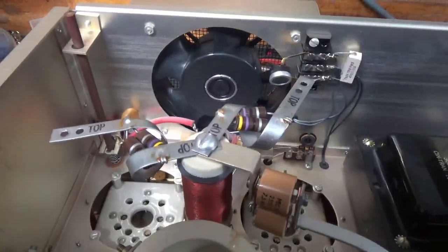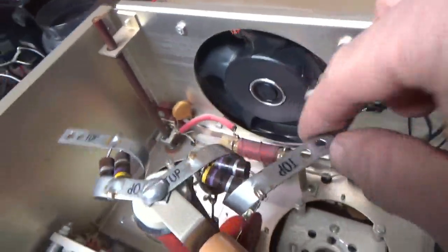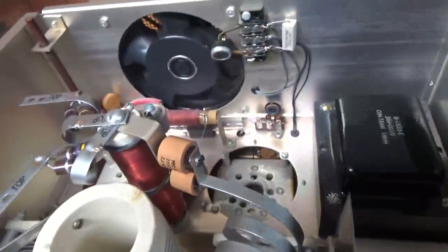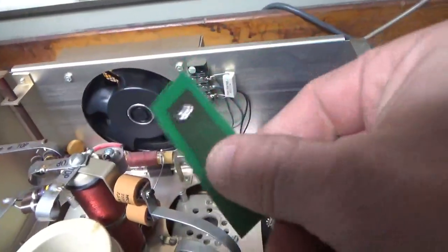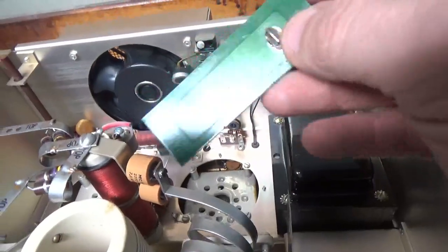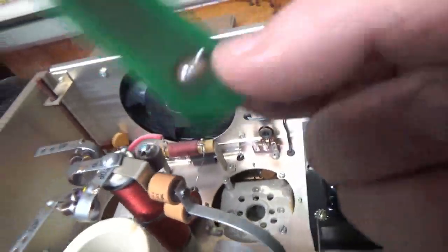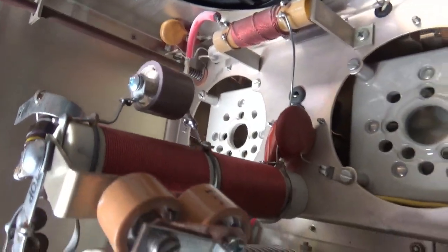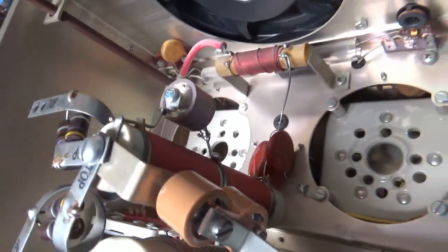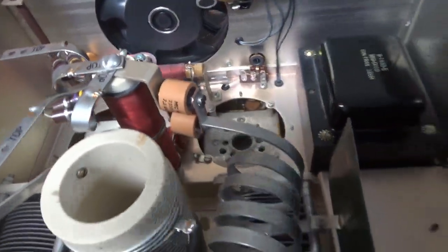I checked the dropping resistors for the high-voltage meter — they were fine. I always add this cap here. The original one is prone to failing — it's a cheap capacitor trick and you don't want that to happen. So I put a nice doorknob cap in there — it's a 50 pF, great for 7.5 kV. 5 kV is fine also but I just happen to have some 7.5s.